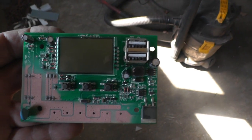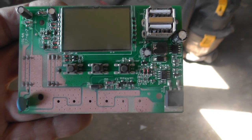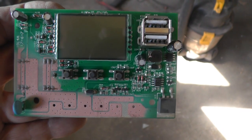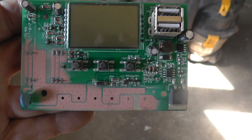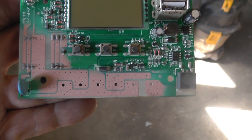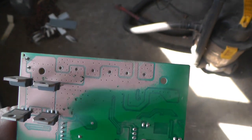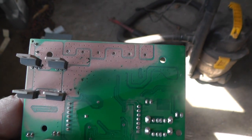Welcome to Papa Junk Shop. I've been messing with these cheap PWM solar controllers — the ones that don't have heavy enough foil or build up with any kind of solder or anything. This is the one that didn't work right from the get-go; I used it to experiment on. The other one I scraped with an X-Acto knife. It doesn't work great, so I thought I wonder if I could sandblast that coating off of the copper traces. It looks like it did alright, and I did the backside too. Now I should be able to run solder on all those and fill them up so they'll carry a little bit more current.